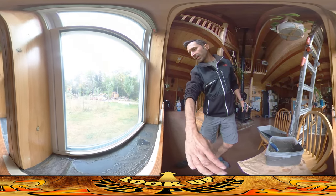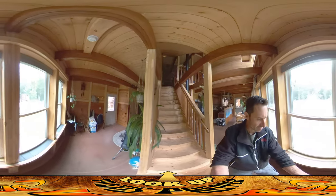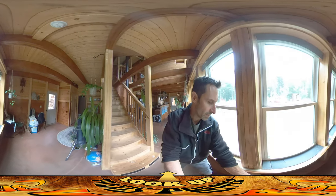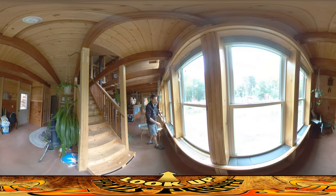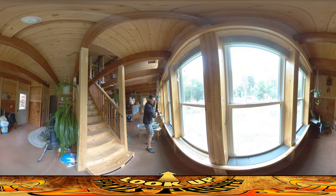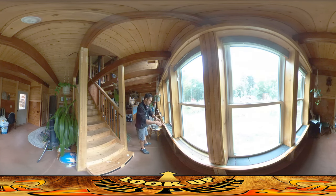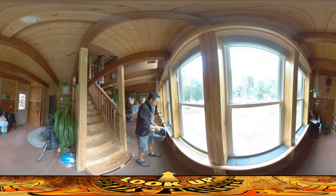The reason I can't clean these up right away is because it moves the tiles if I'm kind of pushing the cement around between the joints, and I make little cavities and stuff. So I need to let it kind of set up a little bit before I start wiping the stuff away, and that is a whole other process. What I want to show you here though is the process that I'm doing to get the tiles in in the first place.